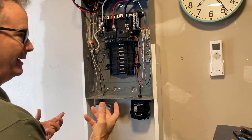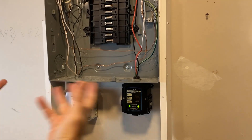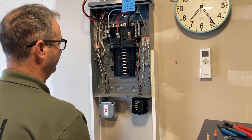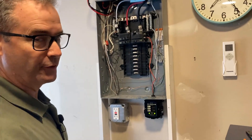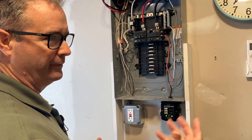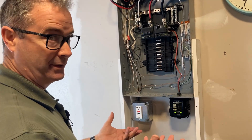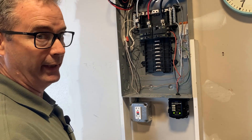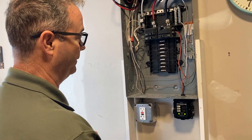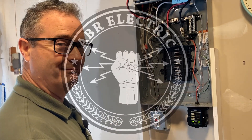It's a great hack that keeps you from having to change the whole panel just to add an arc fault or GFCI breaker. Article 210.8 - the new GFCI requirements from 2017 and especially 2020 - this is the thing with 'readily accessible.' You can't put a GFCI behind the dishwasher or under the sink - it doesn't work. So when you live in an older house, there you go. Click like and subscribe - let's hear your constructive input. Take care.